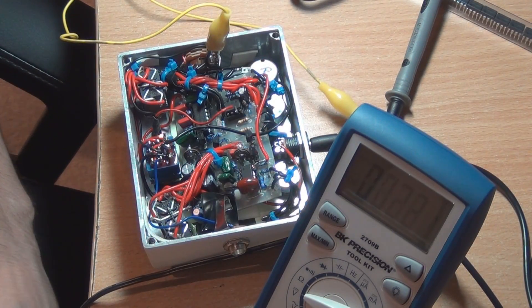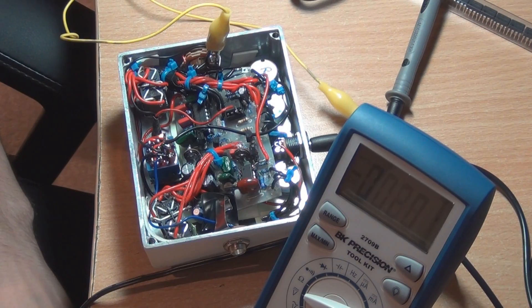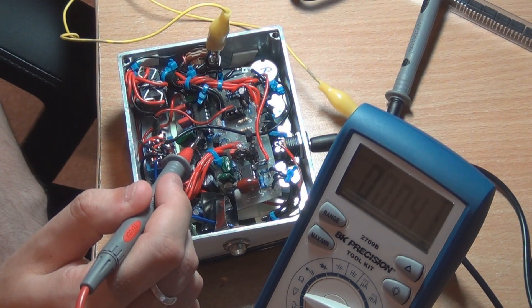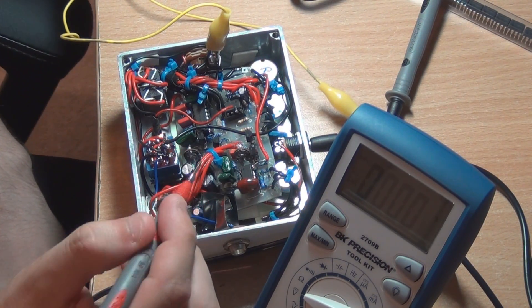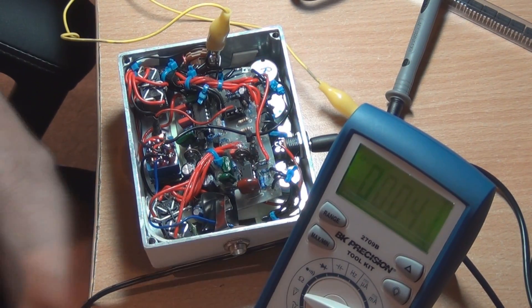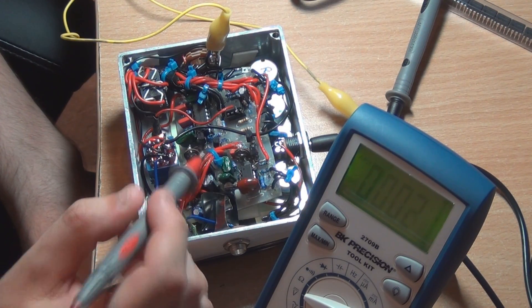If you're checking your FSH and going back and forth trying to work out whether it's going to work, I can tell you straight away: if Q3 doesn't have an oscillating voltage on it, the pedal just won't work. There's no point even testing it until you have a voltage that fluctuates on Q3.